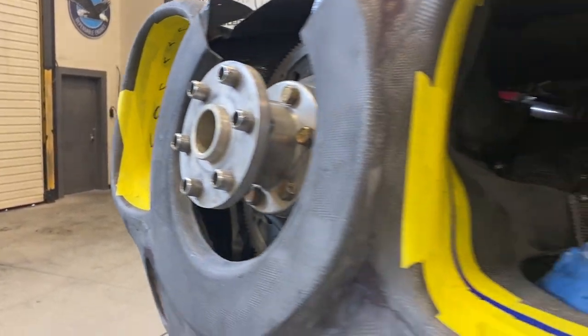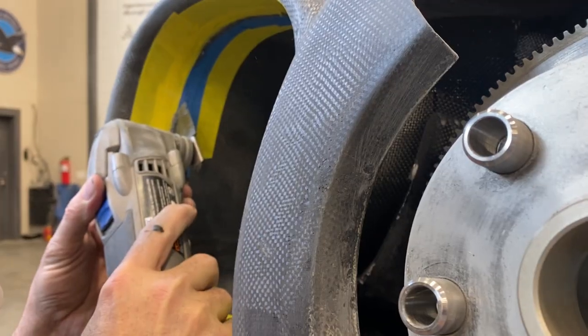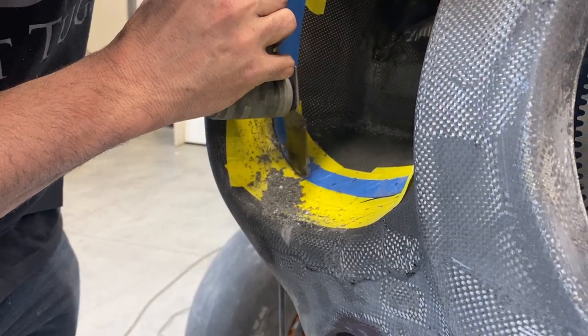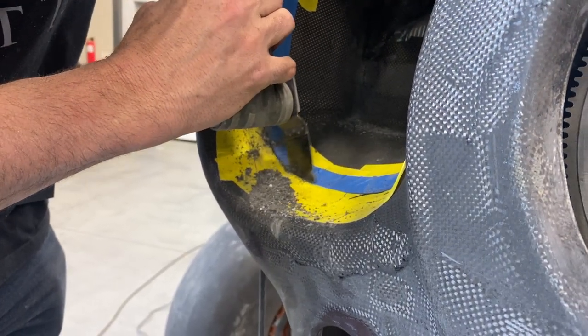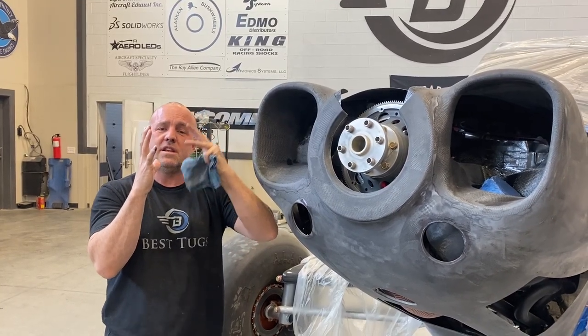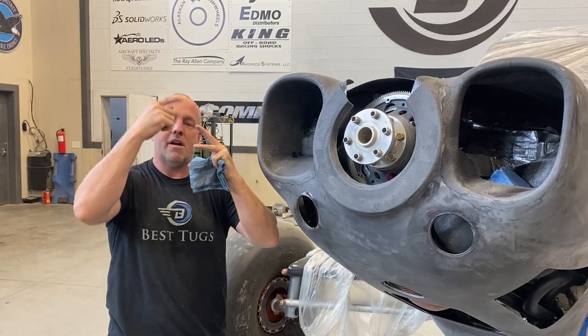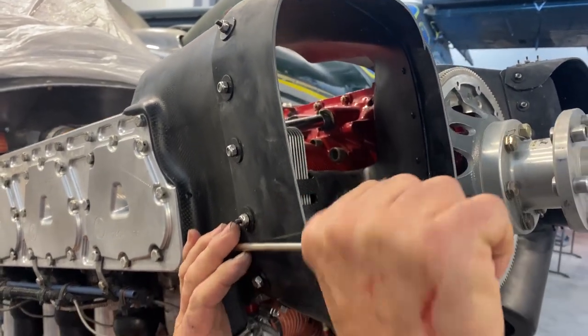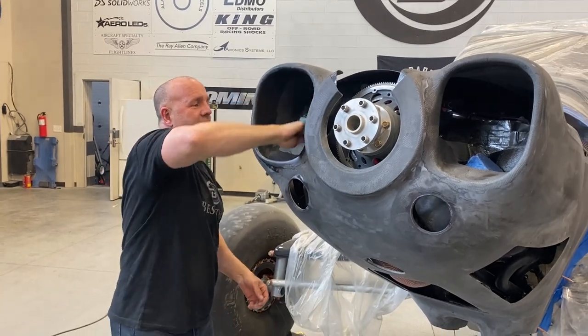Then I'll split it. I'll put a rubber boot that ties the two together when I put the cowling back on, and you'll just see a little hairline around it. And then the engine can shake separately from the cowling, that doesn't move as the engine rocks and twists and vibrates. There'll be a rubber isolator that allows that to happen. But the air should flow better than about any cowling I've done.